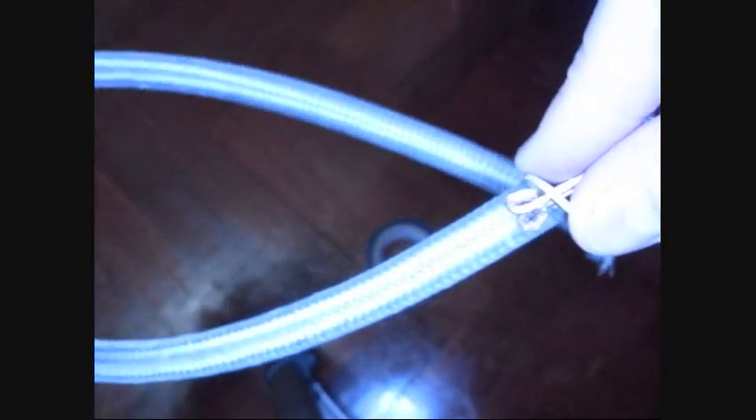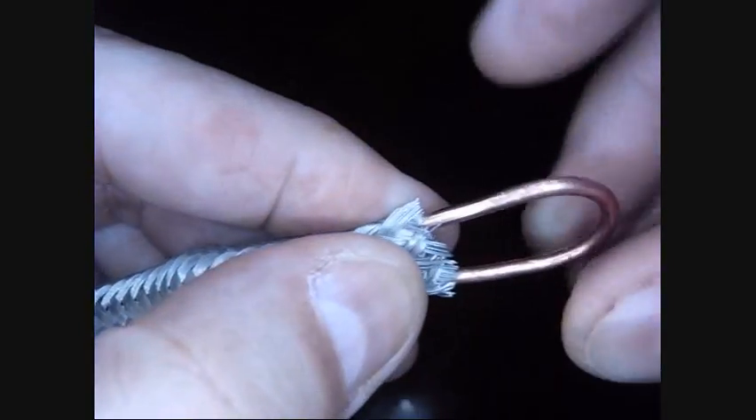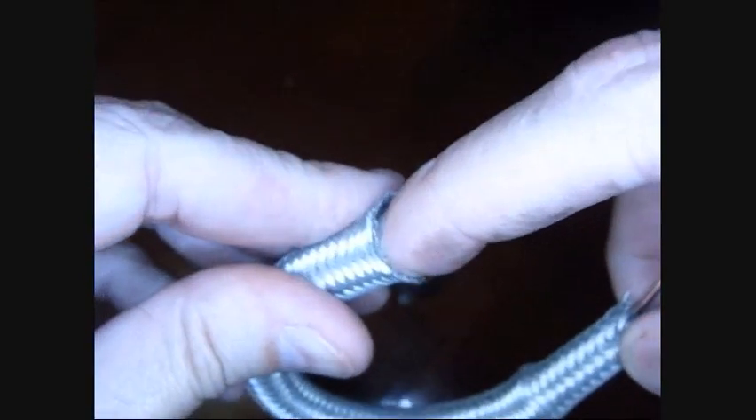Back here I'll feed in the fiber cable connector and do something similar. I'll only need about 15 centimeters, or about 6 inches, of this flexible tubing. I'll pull this up tight and put my tape on there, and again I can use epoxy. I'll put my string in there, then cut it off on this end. The fiber connector will go in there, and again I will stretch it and tape it off. And that's pretty much it — but let me go do this taping and I'll show you that.